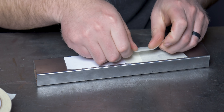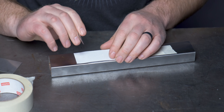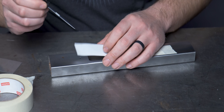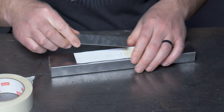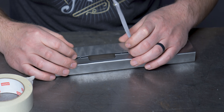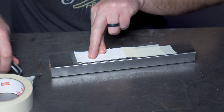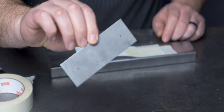You want to make sure the tape is straight and stiff, so that when it lays back down it's right where it was. Then take a pick, a Sharpie, or anything you want — I'm going to use a pick and actually poke the holes. So now I have the holes marked. Then take whatever piece you're trying to fit in there — this works really well for one hole; I'm just using this example with two holes. Place it exactly where you want it, lay the template back on, and mark them. Drill those out and you'll have exact hole placement where you need it.